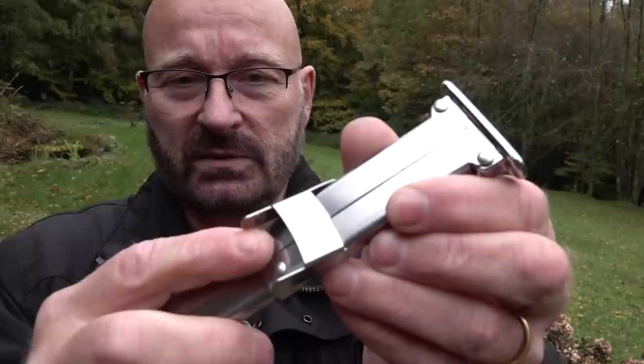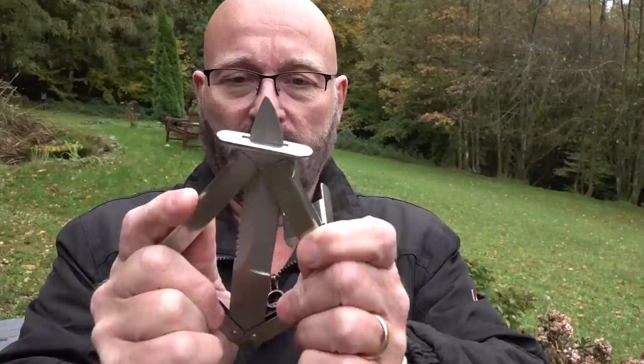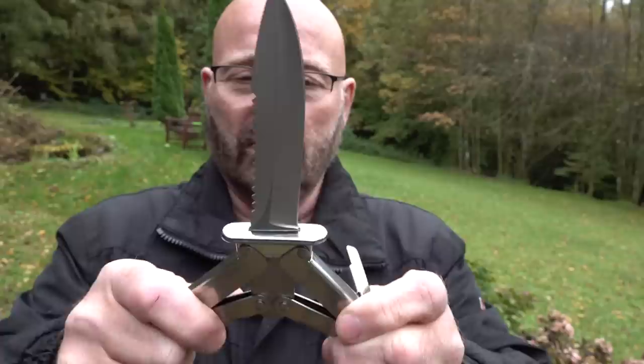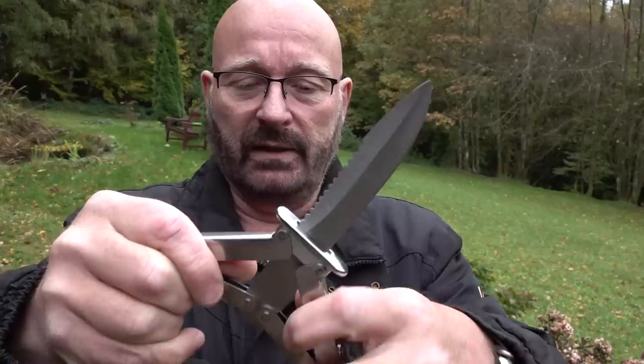First of all, this lock here with this really flimsy little sheet metal — really thin. It is a pantographic knife, as you can see, but you can already see the disadvantage. You can very easily dull the blade or the saw back because it touches the blade since there is really no alignment. So there's no syncing of this whole thing here. You can see it's very easy to cant the blade during the process.